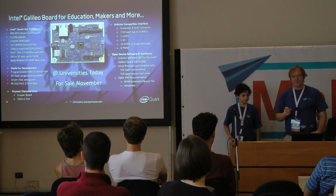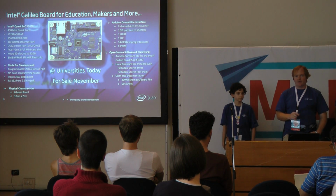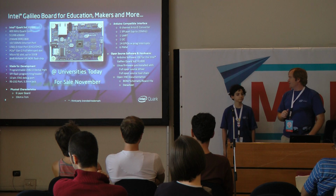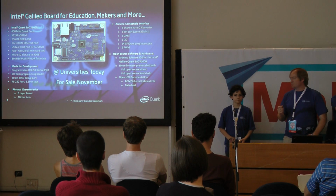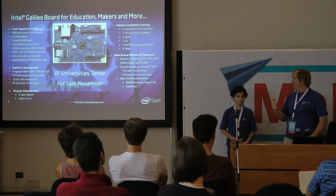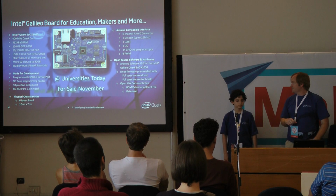So if you want to do line-by-line debug and driver development down into Linux or down into the UEFI stack, you can do that with this and go step by step. We also have an RS-232 port, which looks like an audio jack, but it's not audio. It was meant to save space on the board and offer another access while you're doing programming and other things off the USB device port. You can be driving your Linux output through that RS-232.